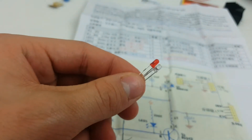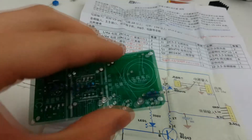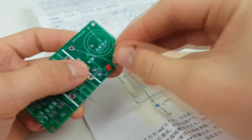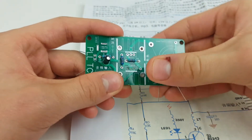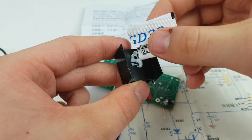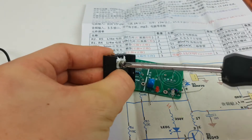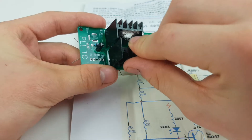I came to the LEDs, but since this is in Chinese, I can't read which is which color, and it doesn't say anything on the PCB either. I'm lucky there is a product image. The electrolytic and ceramic capacitors were easy to identify and insert. The next step is to apply half of the thermal grease onto one heat sink, securing the regulator onto it and the other half of the grease onto the other heat sink, securing the transistor to it. Based on their numbers insert both chips into the corresponding holes on the PCB.